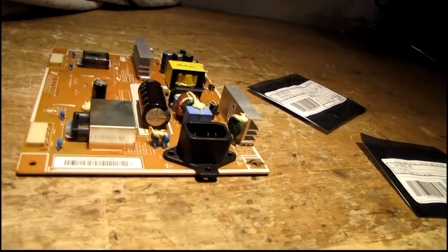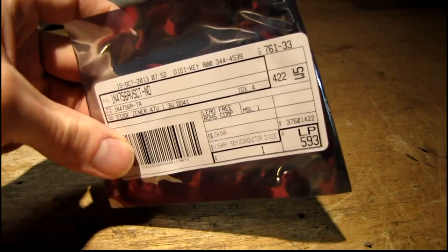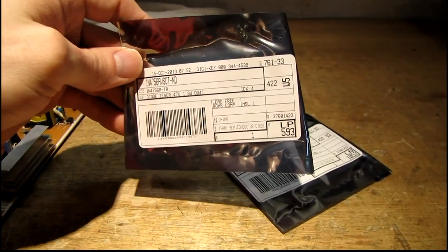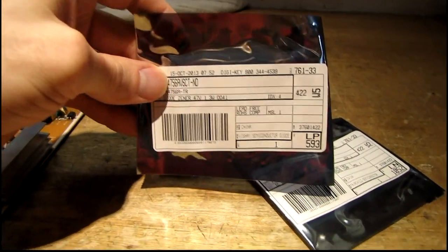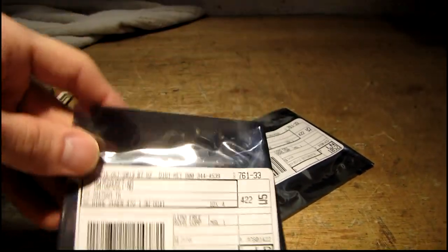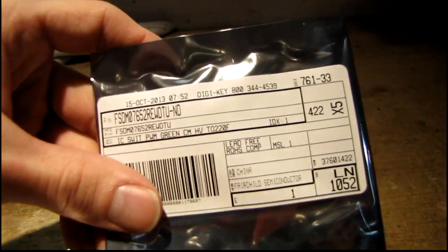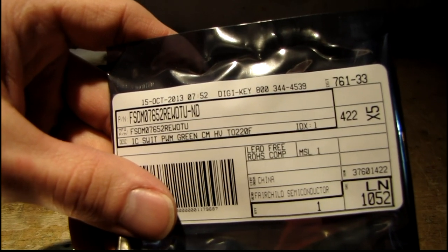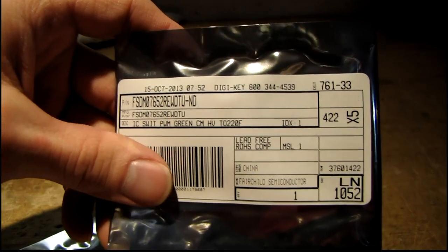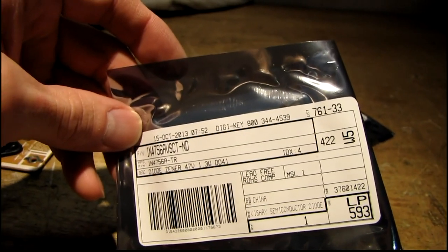I got the approval to do the repair and found the parts I needed at Digikey Electronics. I haven't ordered from them in a long time because I usually use Mouser — mainly because the website is a little easier to deal with and they tend to have slightly lower prices on certain capacitors. But Digikey has a lot of stuff that Mouser doesn't carry, and these Fairchild switching ICs were one example. The part is a FSDM07652R — quite a long part number. And the Zener diode was a 47-volt 1.3-watt 1N4756A, so hopefully that's going to get this thing up and running again.